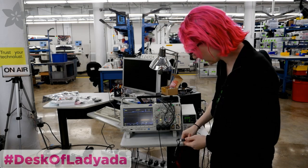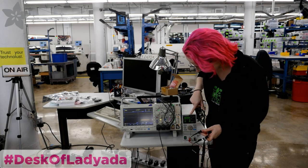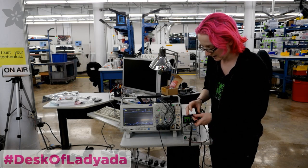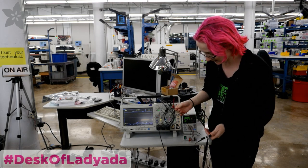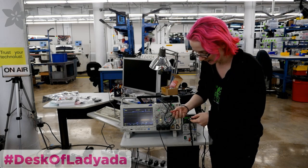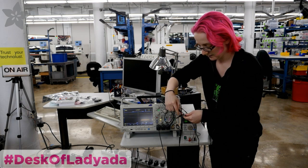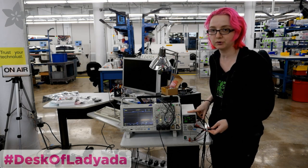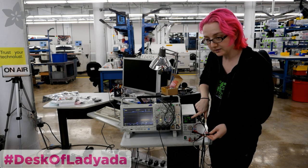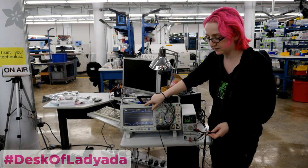So let's now connect up our electronic load. The electronic load is pretty straightforward to use, although it's got this weird off LED — you just gotta watch out for that. Basically you connect with the shortest wires you can, because you're going to be drawing a lot of current through this, connected up to five volts and ground. This actually does a voltage reading, so you can use this to measure the voltage. You can see here it says 5.175, which is pretty much the same as what the oscilloscope reads.